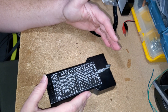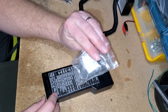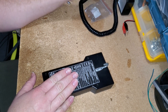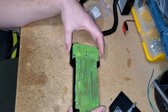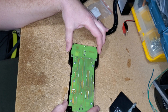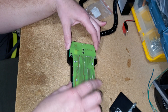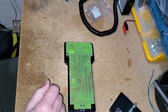The back plate of the controller is held with four screws, which I've already unscrewed — I wanted to check whether the ribbon was actually burnt out on this one, and thankfully on my controller it is not. You unscrew those four screws and take the back plate off. Then the next thing you'll want to do is unscrew the motherboard, which I believe is held by several screws here — actually I think all you've got to do is take off these screws, so let's go ahead and do that.